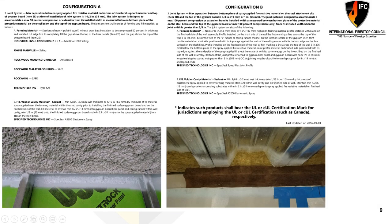If we skip ahead a little bit further, we finally get into the fire stops. We've verified the wall construction, floor construction, the protection of the steel that the wall is attached to, the component attaching the wall to the beam with the Z-clip, the wall construction with our framing and wall design, and potentially the movement with a structural engineer to make sure all these components match the structural design. Now we finally get back into the fire stop design. This listing actually has two different configurations, meaning multiple products could be used.